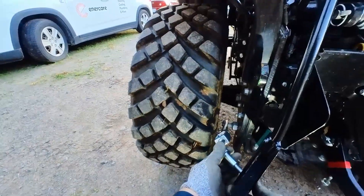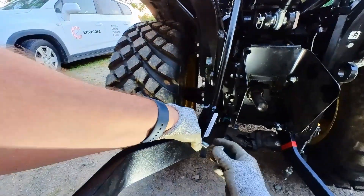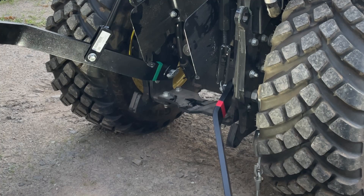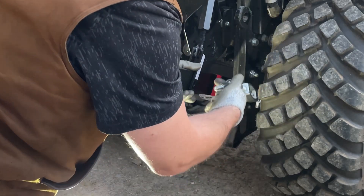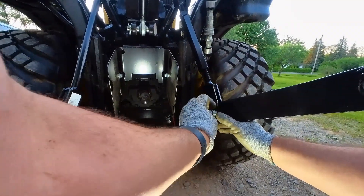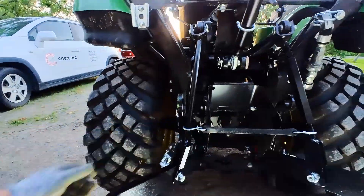The other end of the assembly connects the lift and draft link arms together. You need to hold them all together to get the bolt end through when they all line up. Then on the other side, just spin on the nut. My stabilizer assembly on the right had a small defect in the threads, so I was unable to tighten it much by hand — just one to two turns. I am putting on the supplied bungee cord to keep things all together to make it easier to tighten the nuts down.